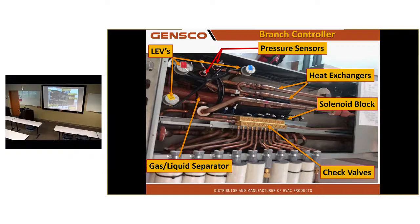One unit inside wants heating. I have enough heat in that refrigerant to separate gas from the liquid and provide heating to one indoor head. It sounds strange that I could have 97-degree saturation temperature coming into that liquid separator and put 140-degree hot gas to an indoor head, but it will do. There's two tube heat exchangers inside.